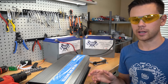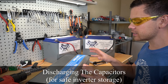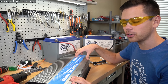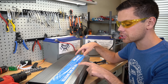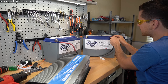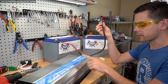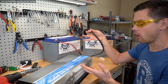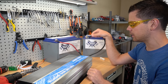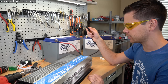The next part of this process is discharging these capacitors safely. This is different and a lot of people don't talk about it. But if you have a higher voltage inverter, you want to discharge these capacitors with a resistor. First, disconnect the negative wire and understand that this negative wire connected to the inverter still has charge — it has energy potential. Some people just short it out on the positive of the inverter, but you don't want to do that with a higher voltage inverter.